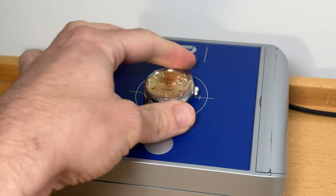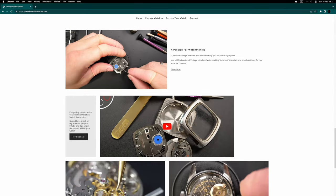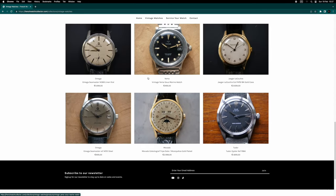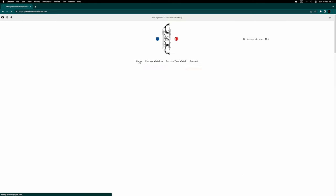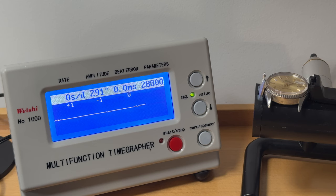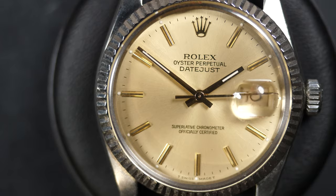Just demagnetizing the watch. I'd also like to mention I have my own website where you can see and buy watches I've restored on the channel — link in the top right corner and in the description. You can also send me your watch for service. After running a while on the timegrapher, the beat error is perfectly at zero, and the amplitude has climbed back up to 290 degrees — a perfect result for a watch that was not working at all initially. Very happy with the result — I hope you liked this service and restoration. See you next time, bye!